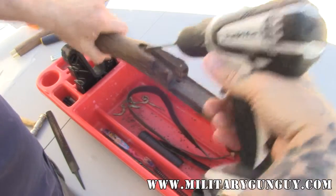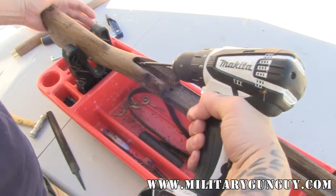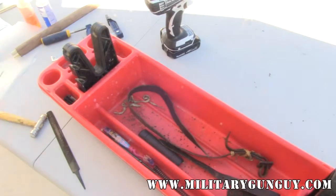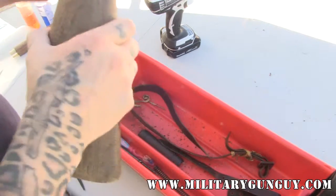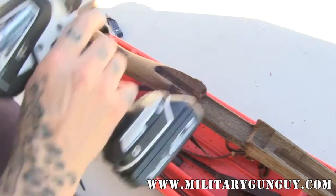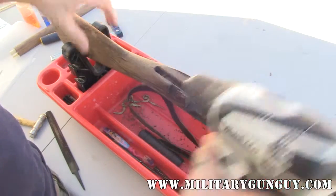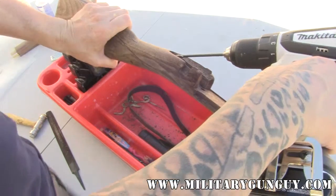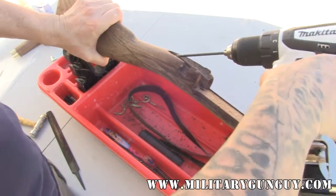That's not a good sound — something got caught. Also, just like in metal work, listening to the sound of what's going on is really important. For example, if you're drilling a trunnion out on an AK-47, you have a nice soft metal sound, and all of a sudden you start hearing crack-crack-crack — now you're hitting hardened steel. It's time to stop and see what's going on.